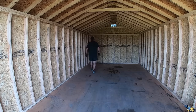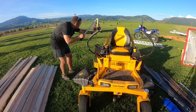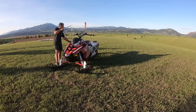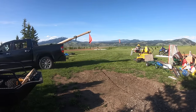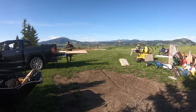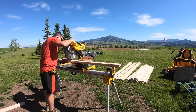This shed is 24 feet long by 12 feet in width, but the techniques and ideas used for this shed can easily be applied to other size sheds. I measured the mower and some other items that might go under the loft and found that I'd need about four feet of clearance for them to fit under it. I picked up a bunch of 2x4 boards and a couple 2x6s to start building the loft and shelving.